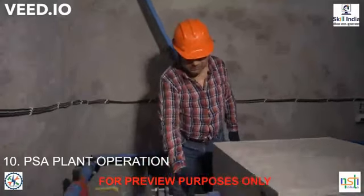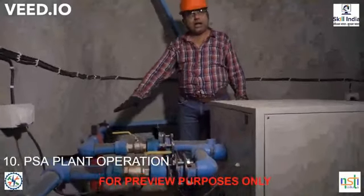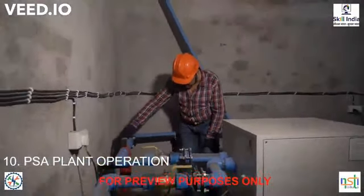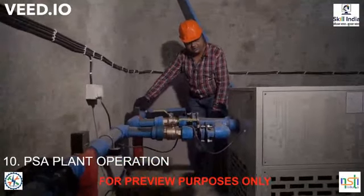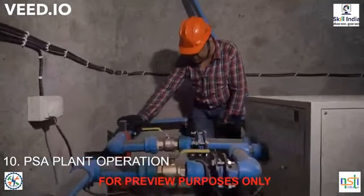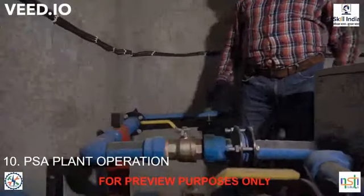This is the inlet part and this is the outlet part. We are getting cold and dry, moisture-separated air. This is a filter regulator, and on top here is the differential pressure gauge. In case of any clogging of the filter, you will find that the pointer will turn from green to red.